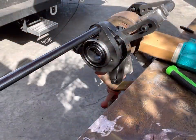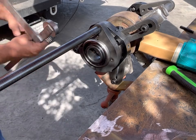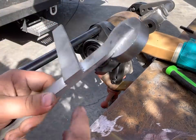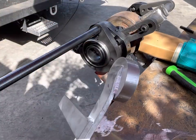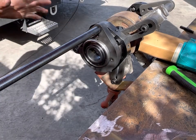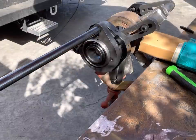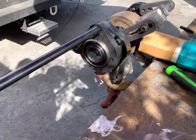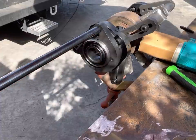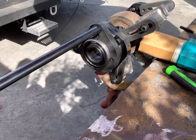All right, so in order for the bore welder to have enough room to do its job, we need to remove this bearing from this housing. So Climax gives you this tool, which I feel like is a little bit flimsy. I have already bent mine, but it hasn't necessarily broke off yet. One thing to note on the newer Climax, newer meaning not as used, bearings, they are very tight coming in and out. So once you get them apart, I would recommend anti-seize.